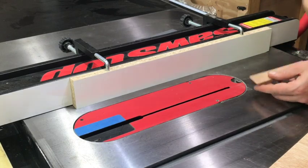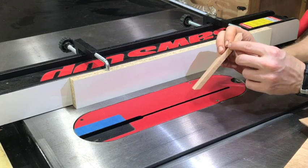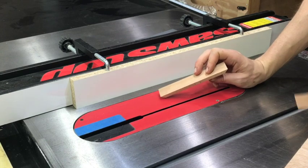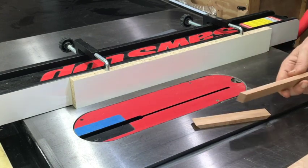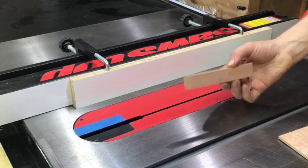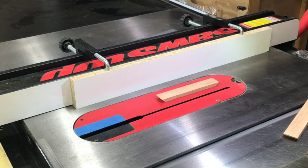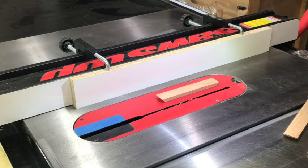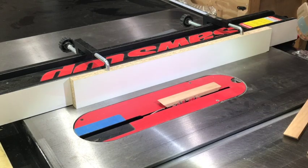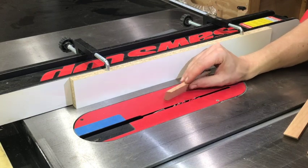Now we're going to want to make sure we don't go too deep into our piece of wood here. We don't want to leave that little part on the bottom super thin and dangerously frail. Now my piece of plywood just barely fits the length of these, so I can't go too far in. I'm going to go, well, maybe 3/32 into the piece of wood as well and see if that fits. But when you're going over to it, always make sure to find the very height, the tallest part of your saw blade, and make sure that is exactly where you want to go. You do not want to cut this part so deep that this little thing is barely hanging on there.